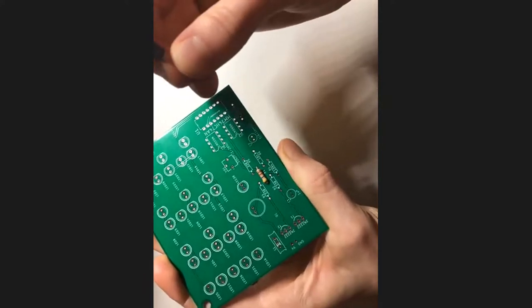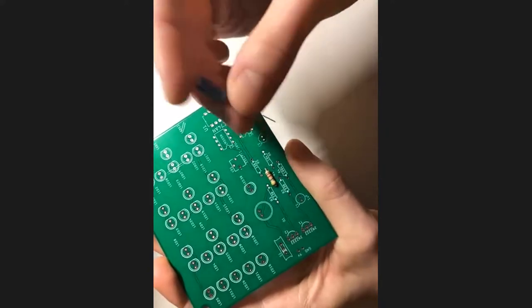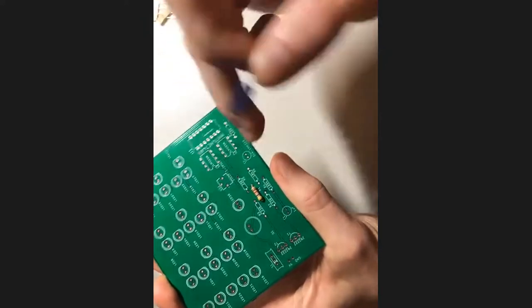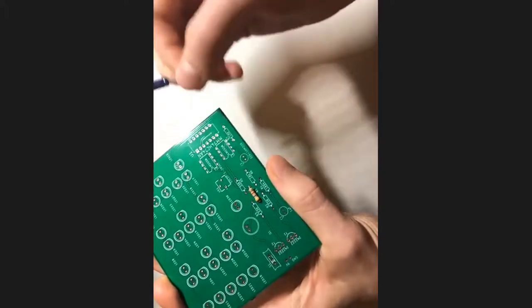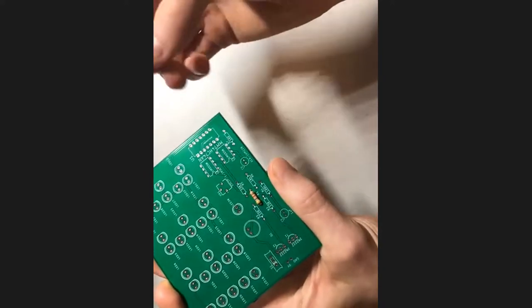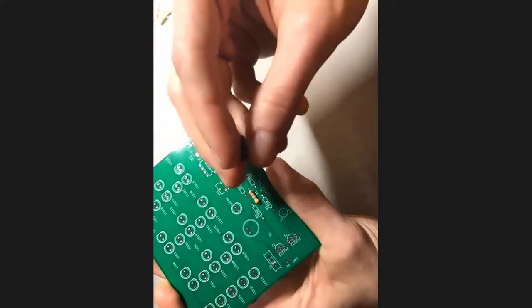Now, if I recall correctly, capacitor one should have a 1 microfarad mark on it. And so that'll actually be the can one like this. And I believe capacitor two is just a film capacitor. I don't think I have one of those around here right now, but it's the little component that looks like it has a little sort of a circular medallion on top and is very thin. So the thin one's capacitor two, this one should be capacitor number one.